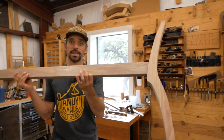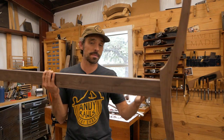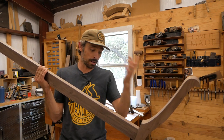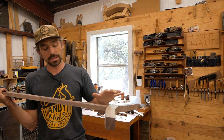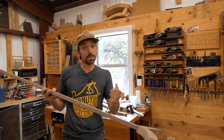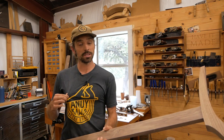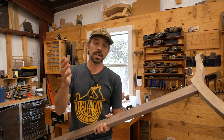So that is how you connect a curved leg to a straight piece. It's a fairly simple process — the challenge is in making your jigs. I've spent quite a bit of time getting this process set up, but once you have your jigs made it's really basic mortise and tenon joinery from there on, and it provides a really strong joint. If you want to see the full build, I'll put the link in the description. If you're interested in owning one of these, I sell them off my website and I'd love to make you one. Any bit of support is much appreciated — appreciate you guys tuning in and we'll see you next time.